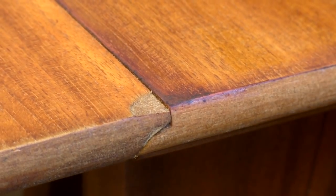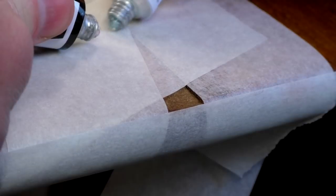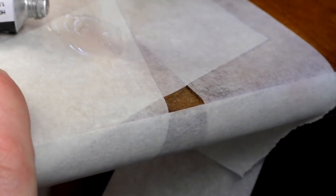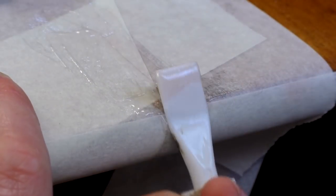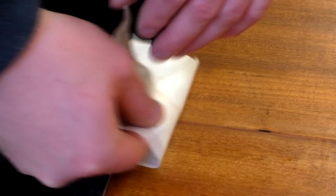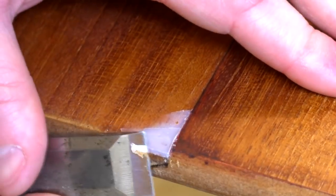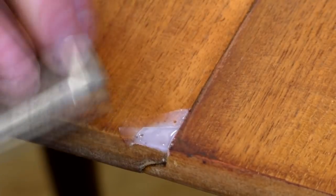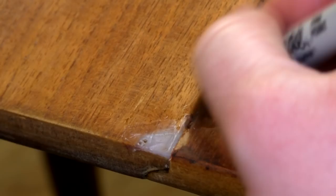Next I could work on the chipped piece of veneer, and I really should have done this before I applied the boiled linseed oil, because I needed to mask around the chipped area with masking tape and it doesn't stick so well to oiled wood even when the oil has fully dried. I mixed up some epoxy to use as a filler. Around 10 minutes after applying I removed the tape and then chiselled away any excess epoxy to get the surface flat and flush at the edges. I used my brown sharpie pen again to add colour over the epoxy and blended it in with my finger before it had a chance to dry.